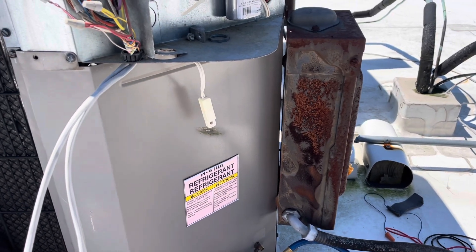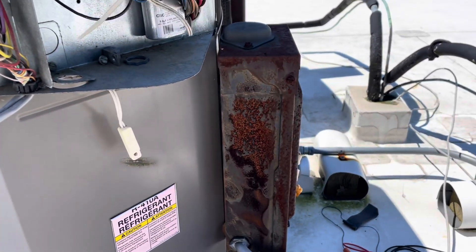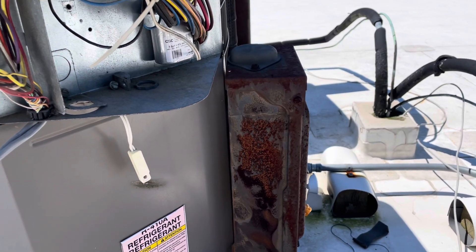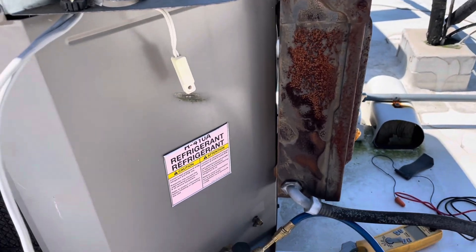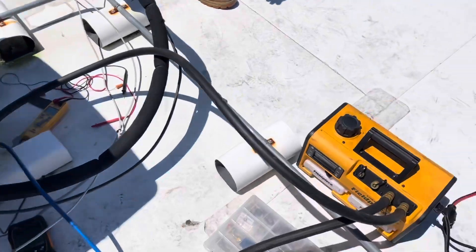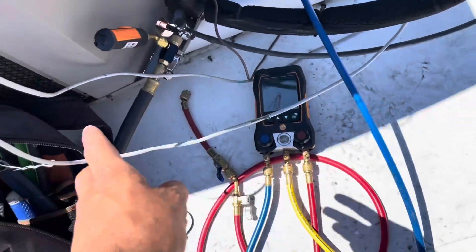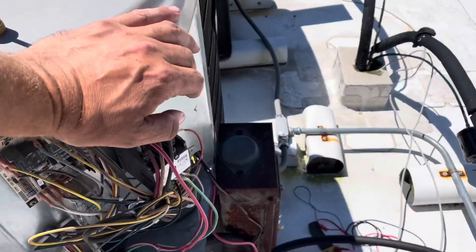The thought process — I'm a little confused about how blowing a fuse there shuts down power to both outdoor units and both air handlers. But maybe they felt that was needed. All right, guys, we got her on vacuum now. We just switched her on. We're going to go get a bite to eat. We still got some wiring to clean up and stuff like that, but we're going to go grab some lunch and come back at it.